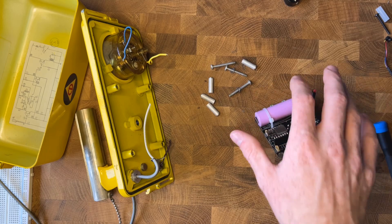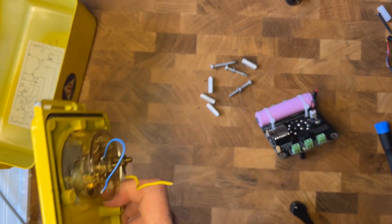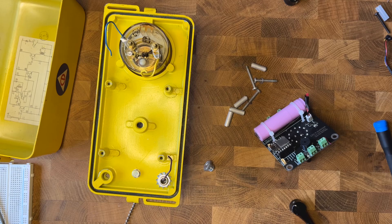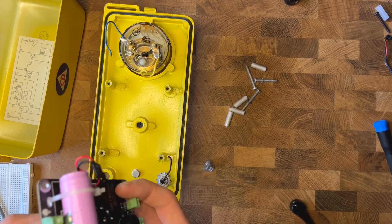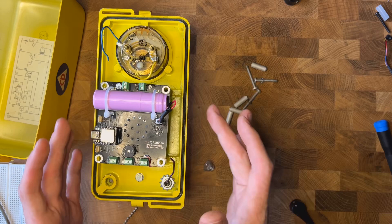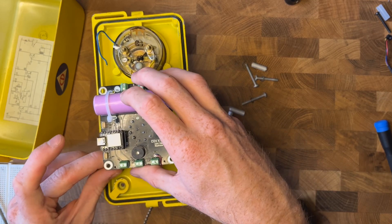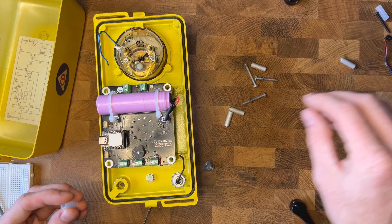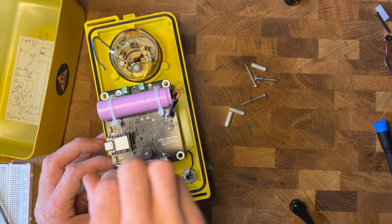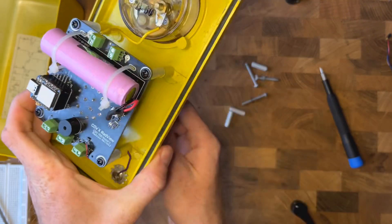To add this on, take your CDV and pull out this wire if you're going to use an internal probe. Now with that plug out, we'll go ahead and insert the board. Orient the microcontroller to the left of the CDV and wiggle it through — you can see the holes line up. Then add your spacers. If your CDV came with spacers those will probably work, but the plastic ones included are confirmed to work. Put a spacer down, drop your screw through, hand tighten all four corners, then snug them down without over-tightening.